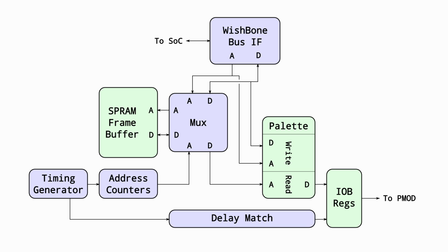That's also how the original Doom worked as far as I understand, since VGA hardware didn't offer any kind of hardware-based double buffer, at least for this mode. It's obviously not ideal. First, we waste time doing a memcopy, and here we also use half of the UP5K SPRAM as a frame buffer instead of having it available as additional cache for the CPU. A better design would have been to only have a line buffer using small block RAMs and preload it via DMA during the horizontal blanking and then draw from it during the active area. Implementing double buffer in this case doesn't require any memcopy from the CPU.